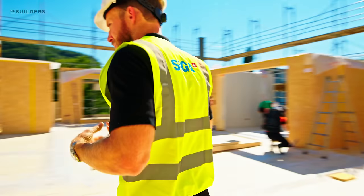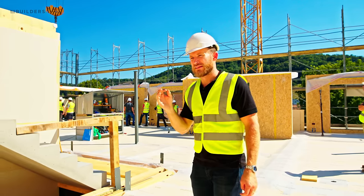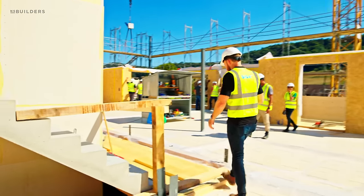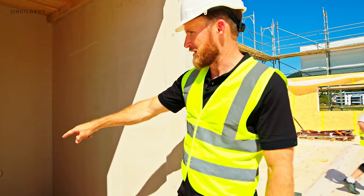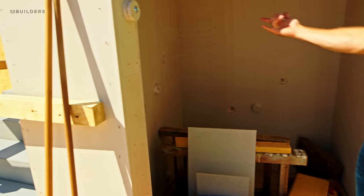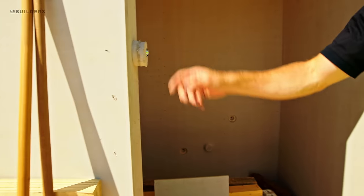I talked about hybrid. You also have some of the precast elements like these stairs, but interestingly, the elevator shaft is now approved to be made of CLT panels. So the elevator shaft from the base all the way up is actually a CLT panel. And then they're getting their fire rating, of course, with this gyp base here. Very interesting. If you take a peek in here, you see some of the connection points, whether they're for hoisting or, you know, those are probably anchor points for the staircase. So they're probably bolting into the concrete stair, and whoever drilled them actually left the pucks and screwed them to the wall so they can come back and just pop those back in and patch them in.